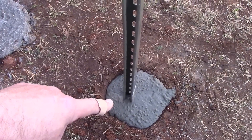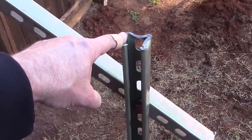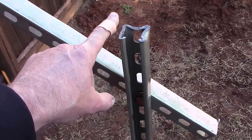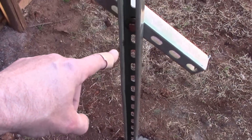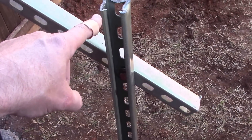I used a sledgehammer and after I dug the hole, I went down about 18 inches. And then I pounded down another 6 or 8 inches on top of that. It's also good grounding for my system too — the solar panels will be grounded now because that goes directly into the earth ground.